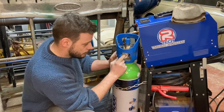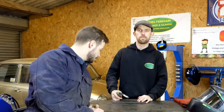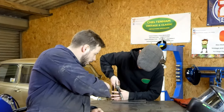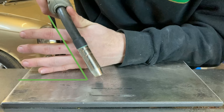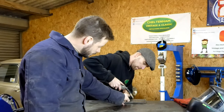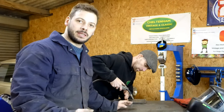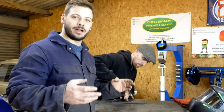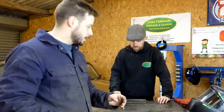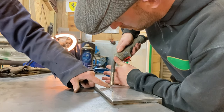On the side it shows you how much you've got in your bottle. Tom's going to demonstrate how you should be holding your welding torch in an ideal situation if you're welding on a bench or for application welding. So he's going to hold it — not quite vertical, it's over by about 5 degrees — and from the other way it's sort of maybe 10 degrees, something like that. That's how it should be in the ideal situation. And away from the actual material you're welding, it should be around 10 millimetres or 3 eighths of an inch.